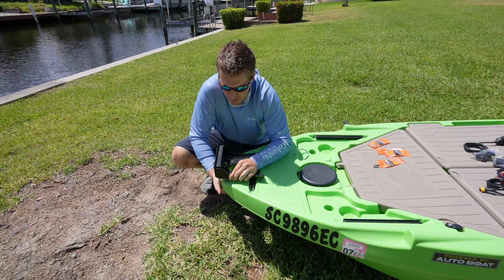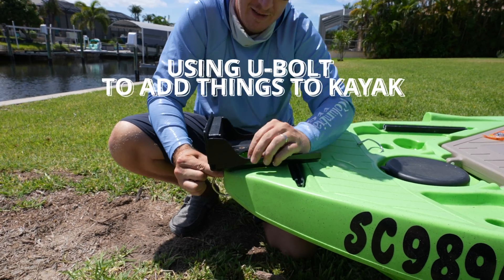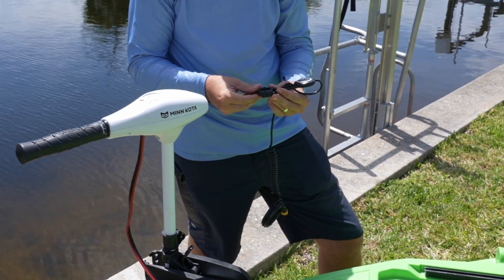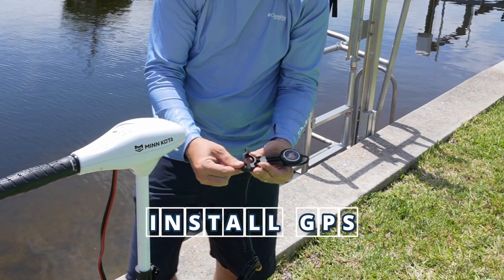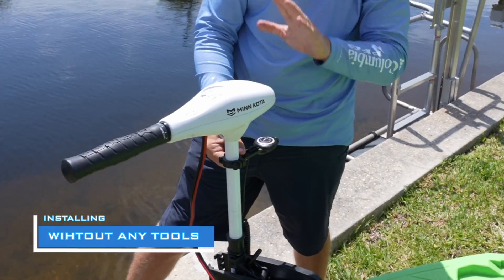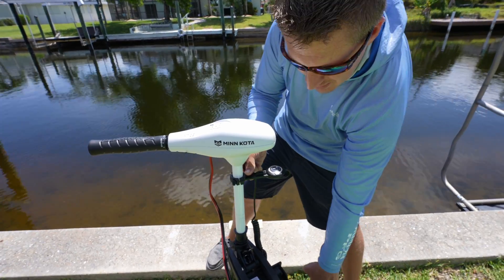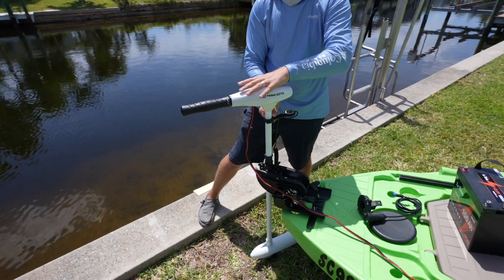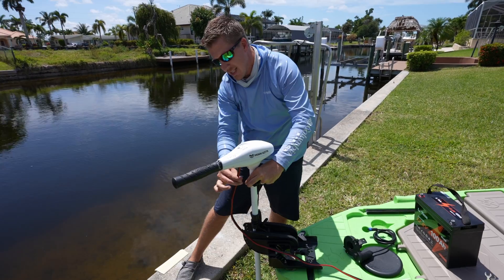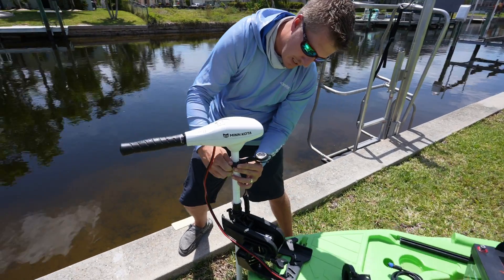I never thought of using a U-bolt to add things to a kayak — that's going to open up so many ideas. So this is the GPS system. Inside is a GPS and a compass. We loosen it up — no tools needed. This goes on the back of the motor. There's a little arrow here; you want to make sure it's pointing in the correct direction relative to the prop. If it rotates, the power cord can go over the GPS and cause interference.